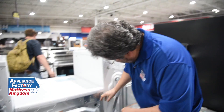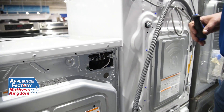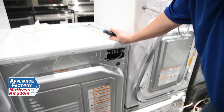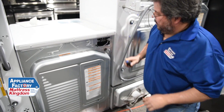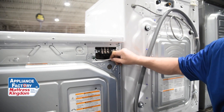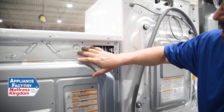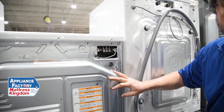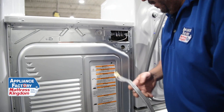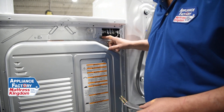I'm going to remove the electrical cover, and we have our electrical box. This is where we're going to hook up the power. If you notice, we have a wire — this white is tied into the neutral here. This is actually grounding the whole case. So if we're using a three-wire, we're going to basically leave this one intact.